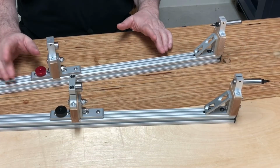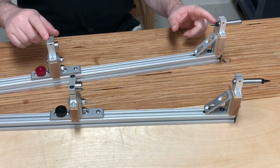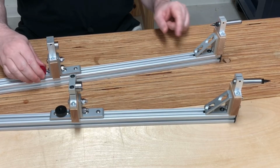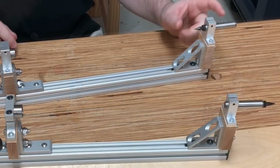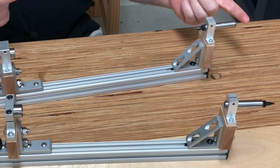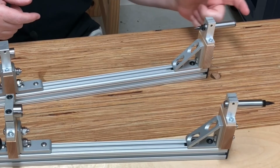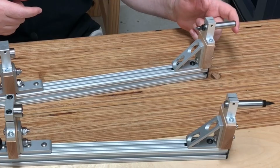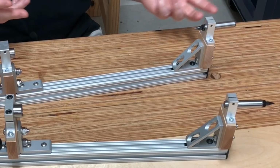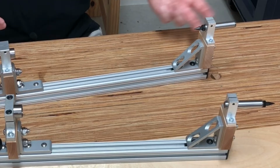First off, the bones of each of these drilling guides are these aluminum extrusions and these two carriages, one fixed and one movable. The fixed carriage holds this 12mm steel rod. This rod will easily fit in common half-inch spindle mortises and chair seats. The end of the rod here is slightly domed and tapered, which minimizes any dents if it's mistakenly dropped on the spindle deck. We do our best to think of everything.